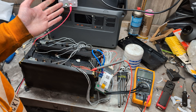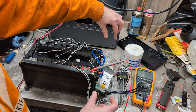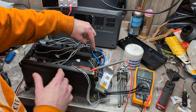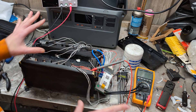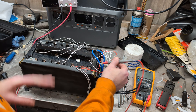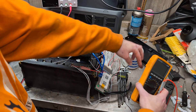There was no connection order in the instructions, so I soldered all the wires on the board, then soldered the big battery connection on, then plugged in the small one and then plugged in the big one, and that seems to have recognised all 16 cells. But the most important bit is to get the cell order in the right order.